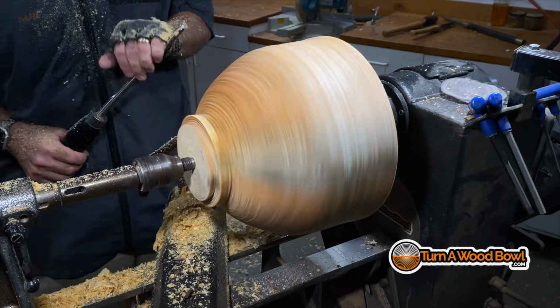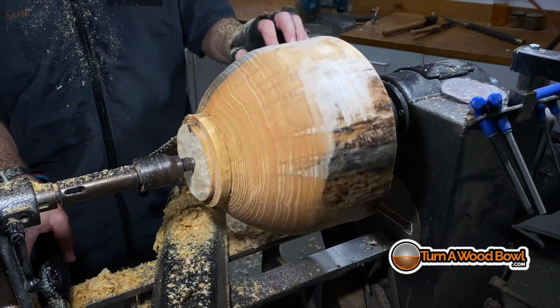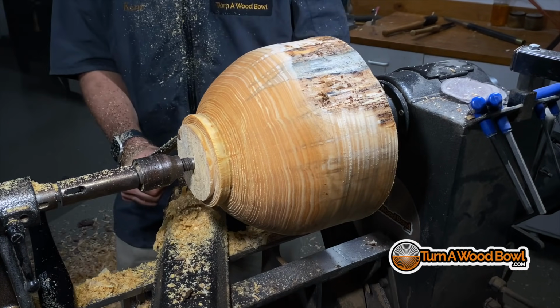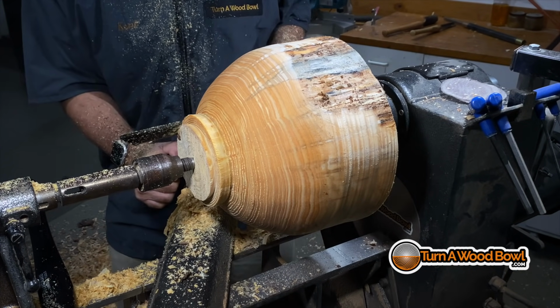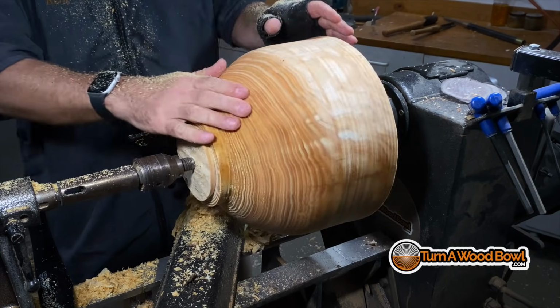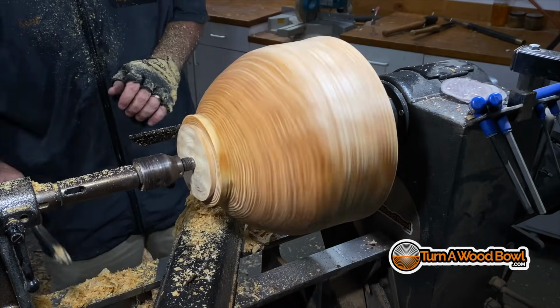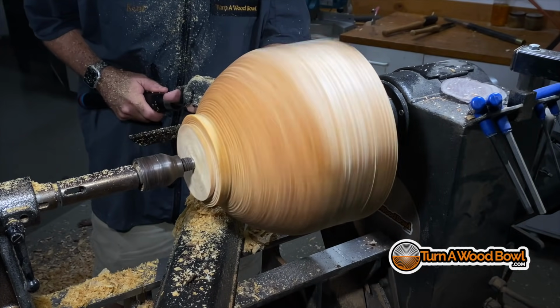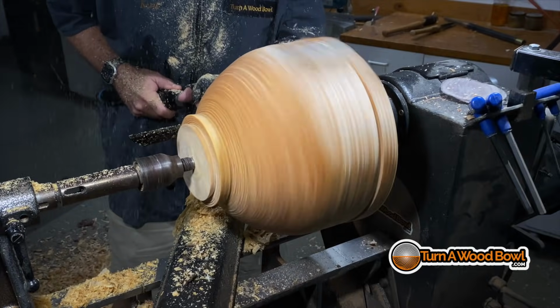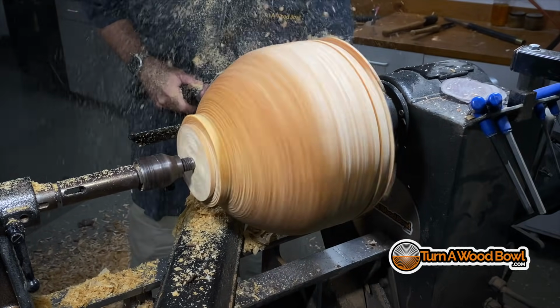So you really don't want to use a mortise or a recessed area on an end grain turning. And again, I hate making definites like that when it comes to turning, because yeah, I know there's opportunities that you can make that happen. And if it works for you in your particular situation, do it. But most of the times, with an end grain turning, you really want to use a tenon because it's going to give you more gripping power on that blank.